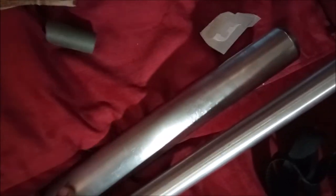There's a bearing up here and some of the balls are missing - there are two bearings, one in here and one on the vane, and I'll give most of the balls to this one. You can of course get new ball bearings - they're plastic ones and I found a place in China to get them - but that's not going to happen before I go to French Guiana so I'll just have to survive as is. The main shaft got beaten when someone was trying to remove it from the old boat, but both shafts are straight, so nothing's going to be changed there for now.